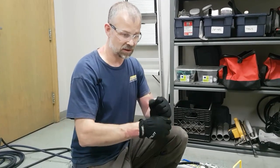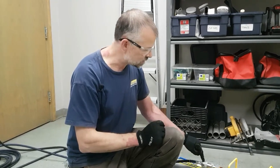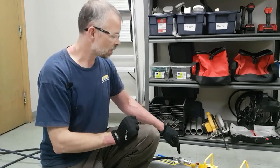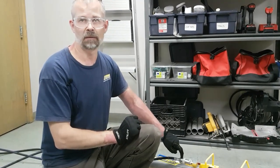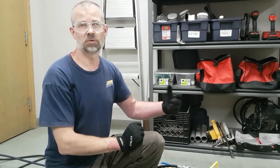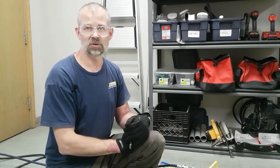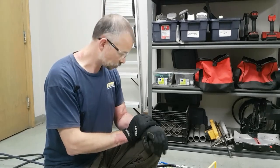You might think that you're tightening it and it's hand tight. If you can't get it any more and you see that gap still with the coupler, I would definitely, the first thing, check that the hose or the cylinder isn't pressurized, and if it is, use your coupler bleed tool, depressurize the hose or the coupler, and then you should be able to get it fully hand tight.